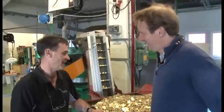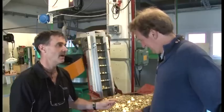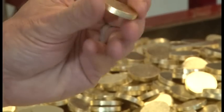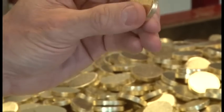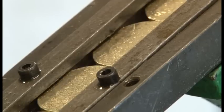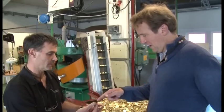This is where it all begins. We start off with brass discs or tombak sheeting and this hasn't changed for over 100 years — same material. We start off with a brass disc and in this part of the factory we produce a basic cup. How do you get from that to that? Basically hit it with a 30-tonne hammer.